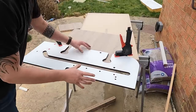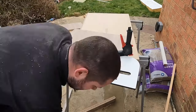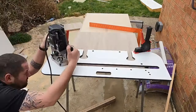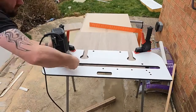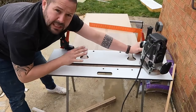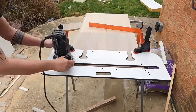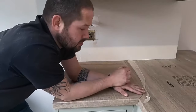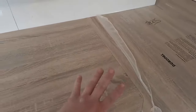Same as the other side - we're going to take this in five passes, nice and easily, just to make sure we're not putting too much strain on the router and giving it a nice clean cut. Then one final cleanup pass nice and slow just to make sure everything is cleaned up. That's our worktop all done and jointed - we're going to go ahead and put it together now. It looks a bit gappy at the moment but once we get the bolts and everything set, that's going to look lovely.